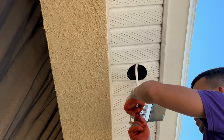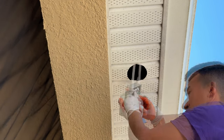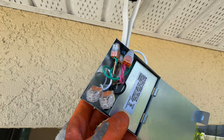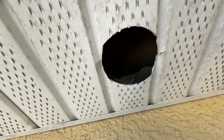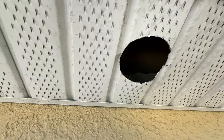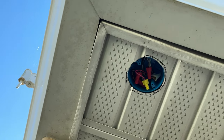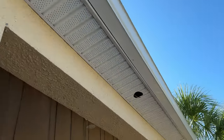I'm going to twist this up just like we're doing wire nuts just to make sure it gets a good tight edge. Then we match the whites and the blacks together with the whites and the blacks on the driver - make sure when you push it through that it goes all the way in, twist it, and once we get that we want to do some wire management in here just to make sure it stays. Here's what it looks like inside the box once we're done - just make sure everything's good and close the lid so it snaps together. Once it's good, put it back up in the hole and onto the ledge up there where it sits, go ahead and put the new light right into the hole and plug it up.